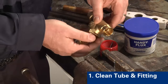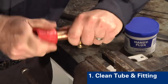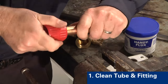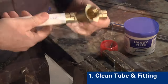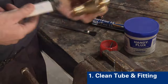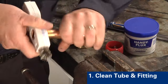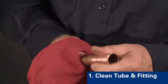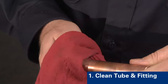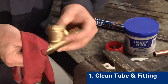Step one is to remove any temperature sensitive parts, then clean the tubing and fitting. Parts should be properly cut and reamed to remove burrs. Cleaning should be performed so that surface contaminants are removed without unwarranted loss of the base metals. Lightly roughen the tube ends and the fitting with wire brushes, steel wool, or fine grades of abrasive papers. Any residual particles in the joint surfaces should be avoided, and any residue remaining after mechanical cleaning must be removed.